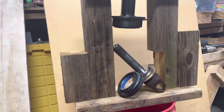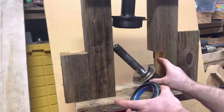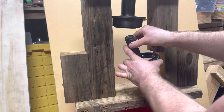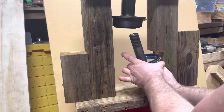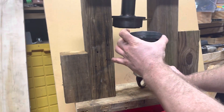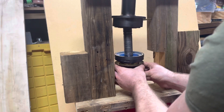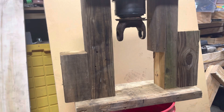First, you're going to want to put this vacuum seal on here — it faces out towards the metal dust and rock shield. Just set it on there and get it centered; you can't start it by hand. Wait — I told you wrong there. That's upside down. You want that steel face facing the press — that would have messed things up in a hurry. That's why you can't fast forward through these things; you'll miss something important like me giving you the wrong directions the first time.